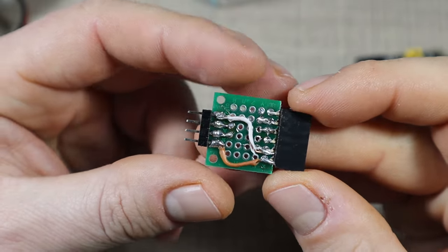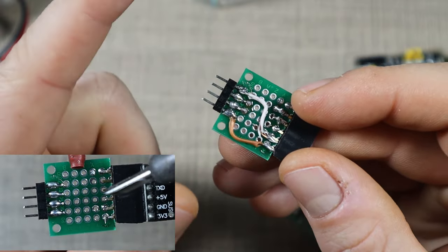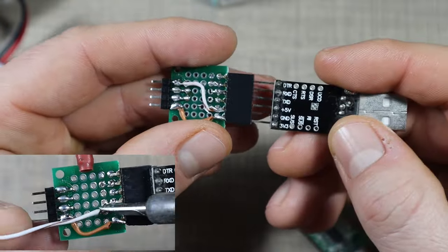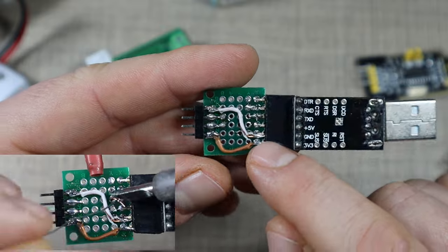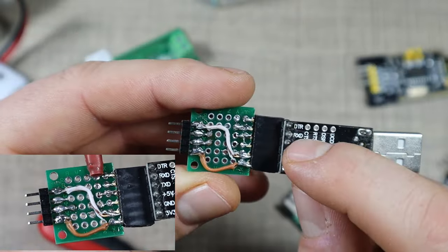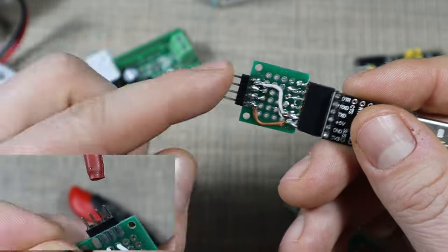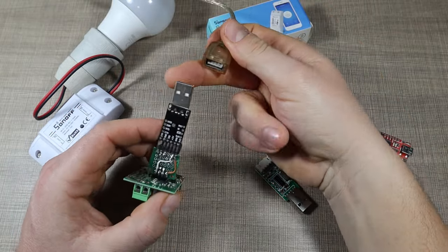To make this jig you will need a piece of perfboard — I've used one of the smallest ones I have. On one side I soldered a male header with four pins that allows me to align them with the four holes on the Sonoff Basic switch, and on the right I have a female header that I can plug directly into the adapter. That breaks out the correct pins for programming the switch: at the end we have 3.3V, next to it is ground going to the far pin on the right, then TX connected from the bottom going to the pin next to 5 volts, and finally RX going to the pin next to ground. Every time this gives us the right combination to connect and program the chip.